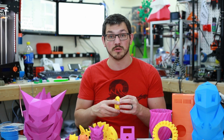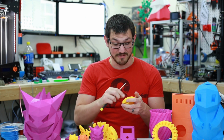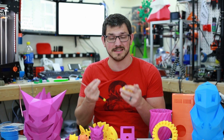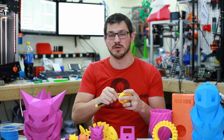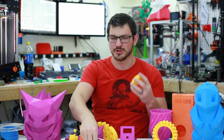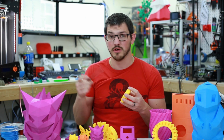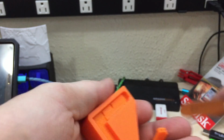When you're printing on support and you have support there, the support comes off super easily and very cleanly as well. I claim that also to be good support settings in Simplify 3D, but this is honestly some of the easiest support I've ever had come off of models. I tried doing a little video on my phone of me taking out some support for the legs on the Ender 2 that I printed in the orange PLA. I literally was able to take my putty knife, put it in the side, crack it twice, and then the entire support just popped right off.